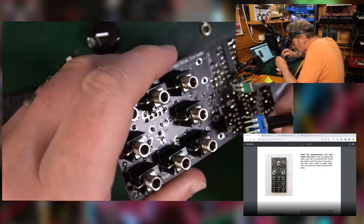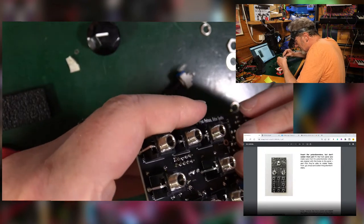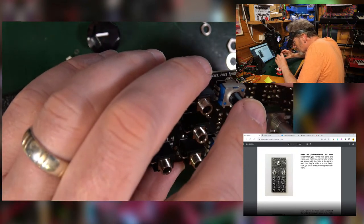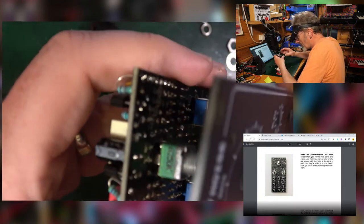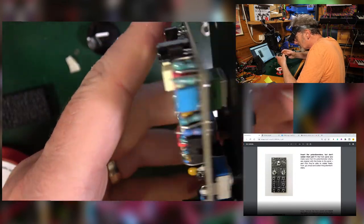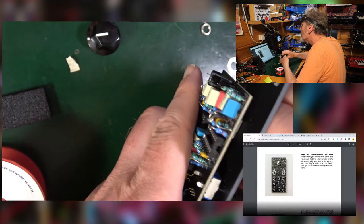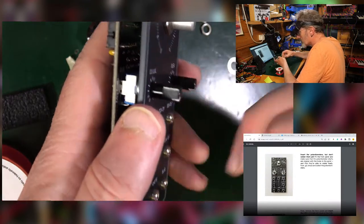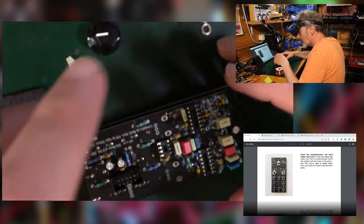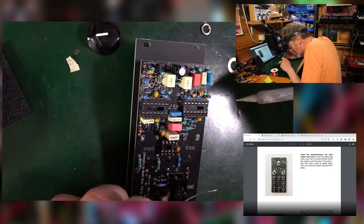Should go in quite nicely, although if you've had them in the breadboard like me, they might be a little bit misaligned. So those two are both the same, so don't solder them. Put this on for the exact same reasons as I did for the other one. Now these are a little low, but they're not being screwed on, so that doesn't matter. Just want the big nut on here, and then put one, if not two, nuts on the bottom, just to hold it there while you solder it in. You can find the holes.